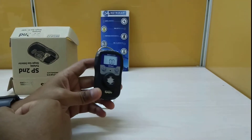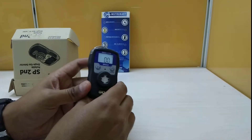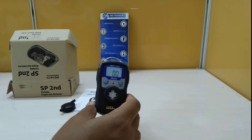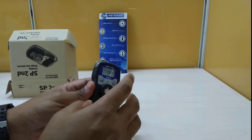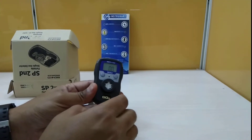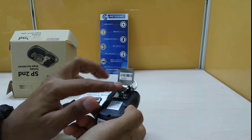The range for this instrument is up to 20 ppm and the resolution is 1 ppm. It has an accuracy of plus or minus 3 ppm on full scale, a digital LCD screen, and two buzzers which can be set to two set points for alarms.